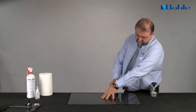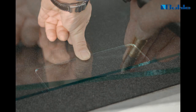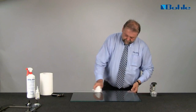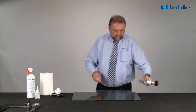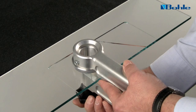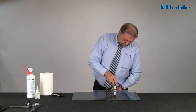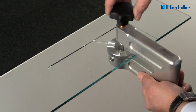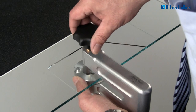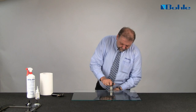Do not tap the glass. Now the cutout must be safely removed. This requires that a trapezoid-shaped segment be cut. Put your left thumb in the middle of the shape and guide the glass cutter in a trailing free-hand position with your right hand, holding the glass cutter at approximately 70 degrees. The auxiliary cuts must be opened likewise from both sides. The resulting trapezoid must be fixated with the cut opener, and the piece of glass is simply pulled out without twisting.